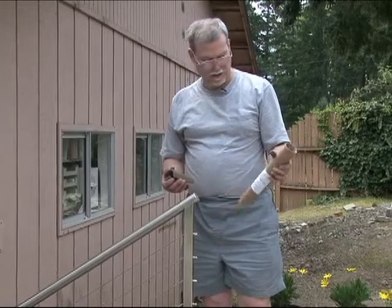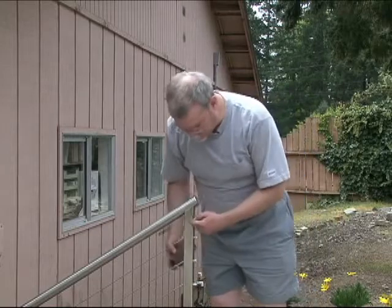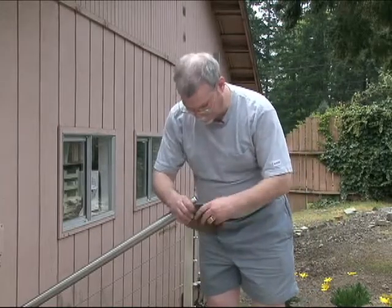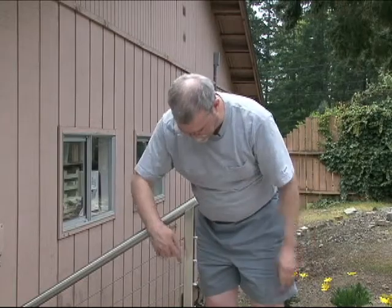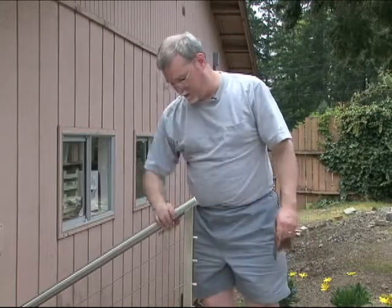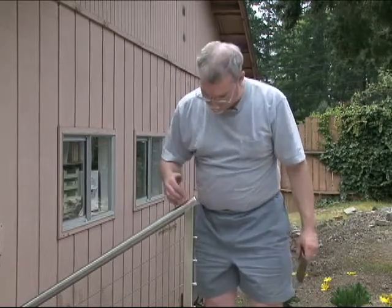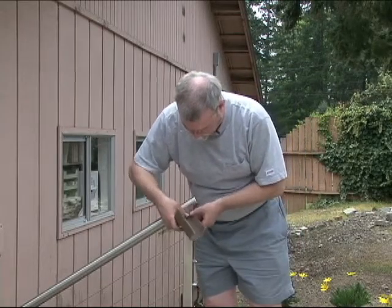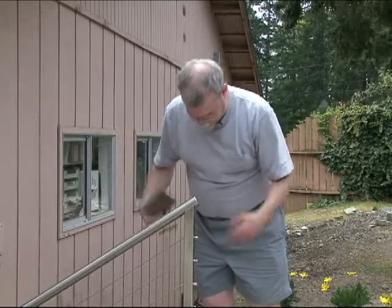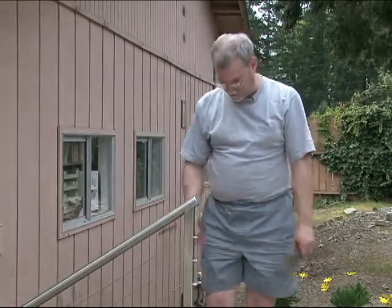This is the passivating kit, and it has a piece of Scotch-Brite in it. If you have any scratches or something in here, this stuff will take it out. What you want to do is go the same exact direction that you already see and try and go in straight lines. If you have to do it on the handrail or this top piece, you need to go around. A lot of times you'll have to go around this way, get this right, and then come back in here with just an edge and get this little spot right here. So your lines, if you want to be that accurate. So that's basically it. You got everything you need.